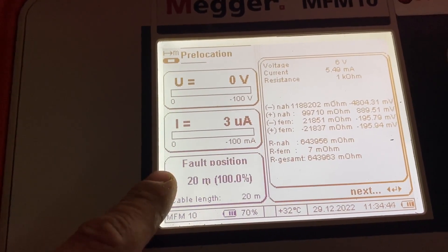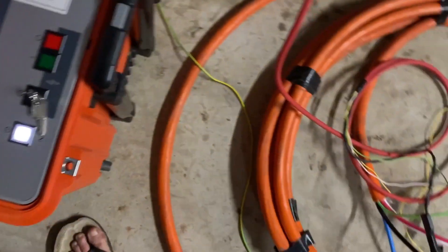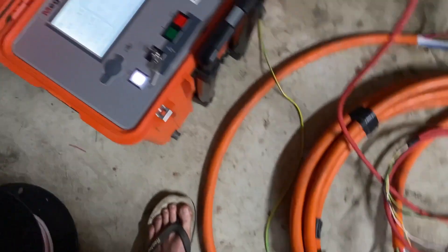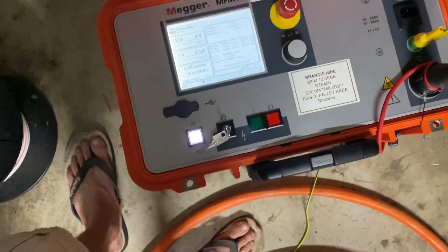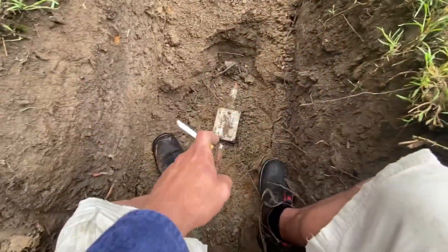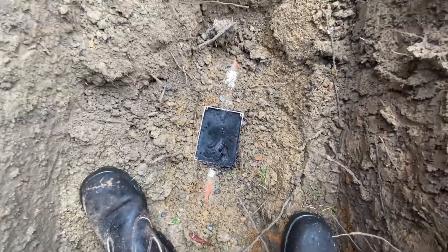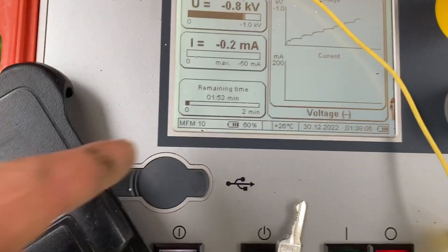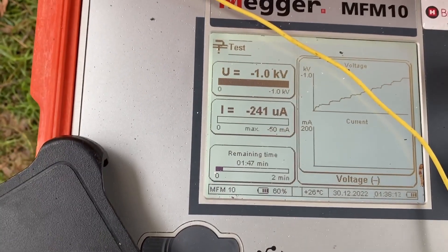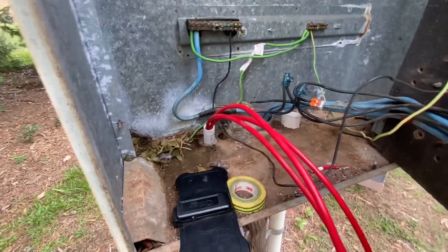20 meters - there you go! It actually detected the end of the circuit. These results are excellent - this is exactly what I was looking for. I only tested at 100 volts too. How's this for a money shot - there's my line, here's my join. She's burnt to a crisp! Look at the reading now - we had it at 200 milliamps before, now it's sitting in microamps at about a kilovolt. Beautiful - it's a cool bit of kit this.